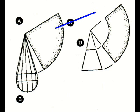With only a small number of steps, the difference would be enough to make a noticeable error in the developed length, but with 12 or more divisions, accuracy is sufficient for practical purposes. Looked at another way, the dividers are stepping off the equivalent of a 12-sided cone instead of a round one. A truncated cone, which is what the megaphone is, is dealt with in a similar way by drawing another arc to mark the top edge, figure 611D."